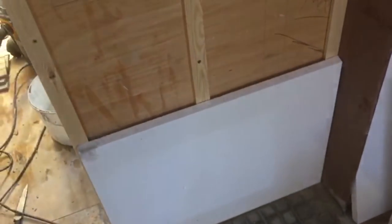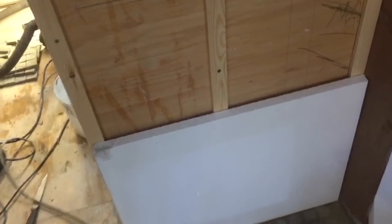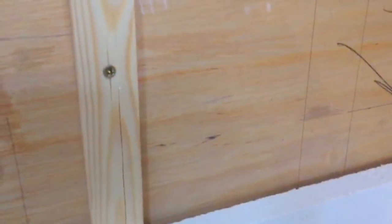But in between that now I'm in the, what do you call it, the saloon, and I'm just putting the fireproof panels on where the stove's going. So what I've done is I've created a 10mm air gap, so it's going to be 10mm off the ground and give me an air gap and leave a gap at the top. And that's what one of the websites I looked at gives you a guide for, doing chimneys and stoves and that. So yeah, this is good.